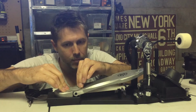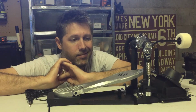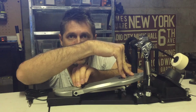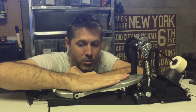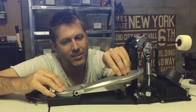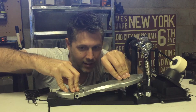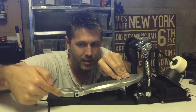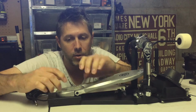That way, if I push down, it's activating the switch underneath. It kind of works, but the problem is when you're pressing down very heavily with the front of your heel, you're exerting enough pressure with your whole foot to push the whole switch down, even if you don't mean to. So it became very hard to press that without pushing the heel part down. See what I mean? Even if I take the pressure off, there's enough pressure from my toe to keep the heel switch down. And again, it just didn't really work the way I'd planned.